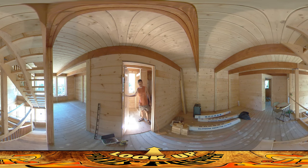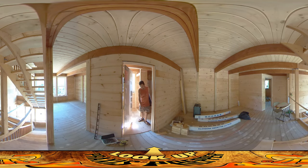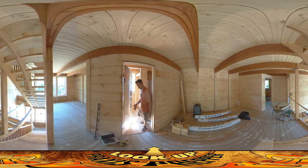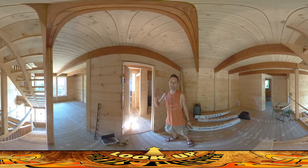I'm not going to set that nail yet because I want to test the door and make sure it closes properly. That looks good — it's not sticking out too far where the door can't close, and it's not puckered in so much that there's too much of a gap. I double-checked and it's beautiful. If you were having trouble with the door, you can always take a rasp and take your door down a little bit, then sand it. So I'm going to work on getting the doors up and then the tiles. There's just a lot of different things to do, but it's nice just getting all these materials that just got delivered up and into the structure — every day, just a little bit closer. Thanks for watching.